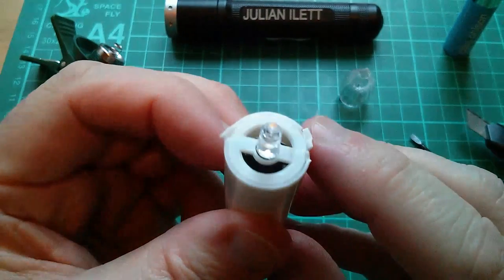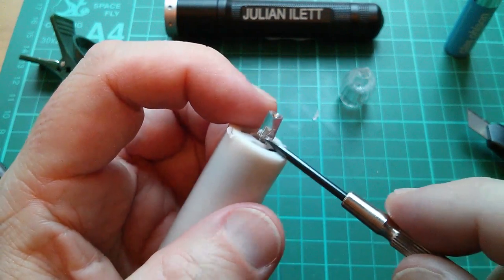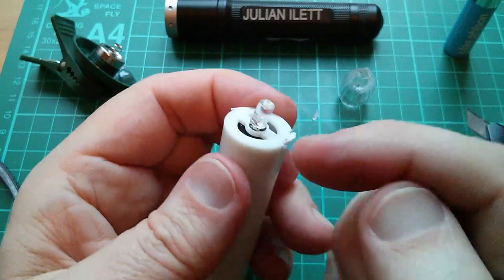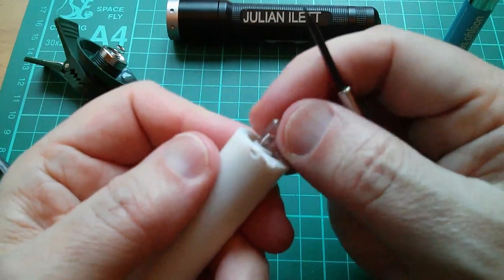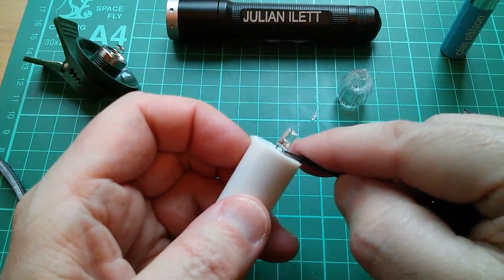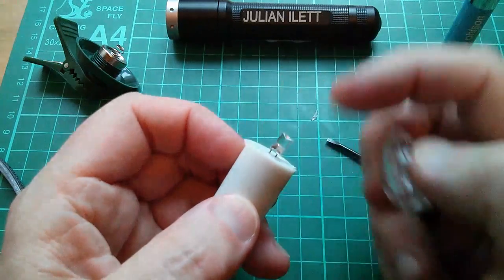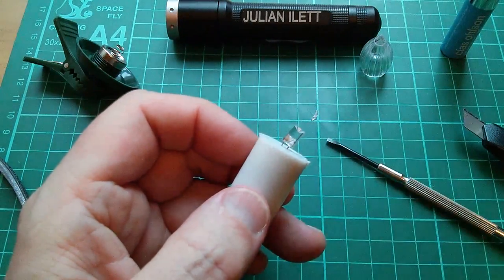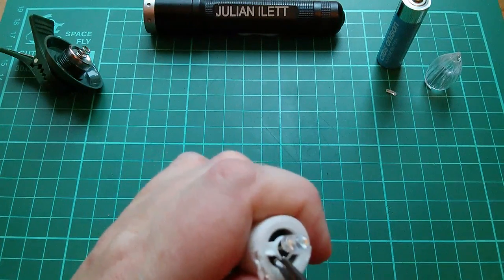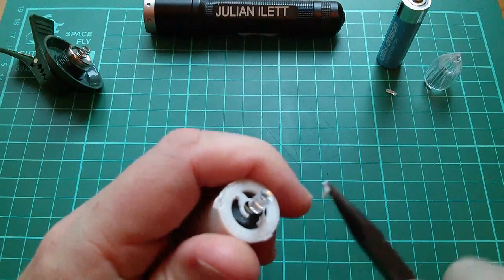I'm making a bit of a mess of this — the cylindrical surround is all a bit disturbed now. Maybe there's a better way to do this. This is only a standard warm white LED, so it's not worth keeping. If I lift that a little bit, because the legs go down and then bend around onto the PCB, and bend it backwards and forwards, hopefully the legs break off just under the base of the LED — I might just be able to get my soldering iron onto these two points to solder a new LED on. There's plenty of height inside the cover, so I can have the LED raised up a little bit.